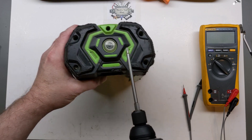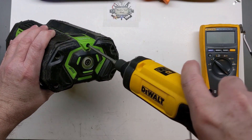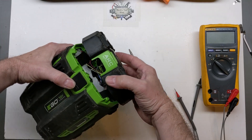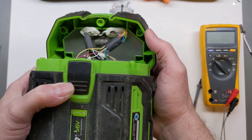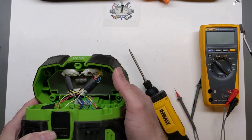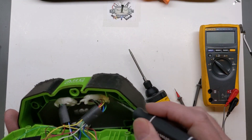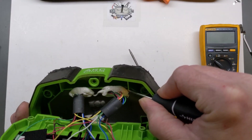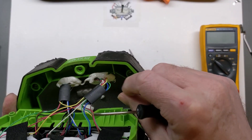The first thing I'm going to do is take my T15 security bit and go around and finish taking off the screws that hold this end cap. We want to be very gentle pulling on this end cap because the wires are attached, and this one has not had any previous work on the BMS board. I'm going to take a little time and dig out this white silicone — it separates from the gray very, very easily.